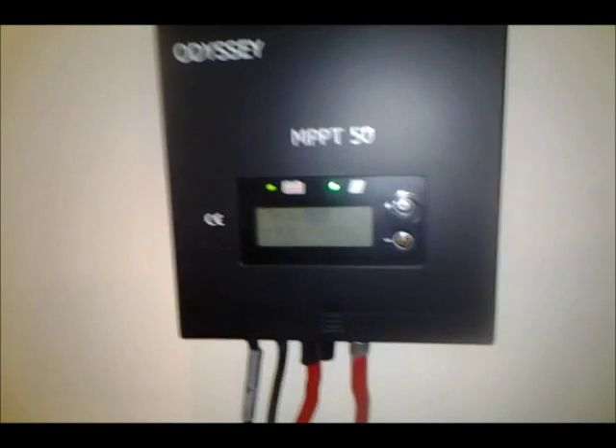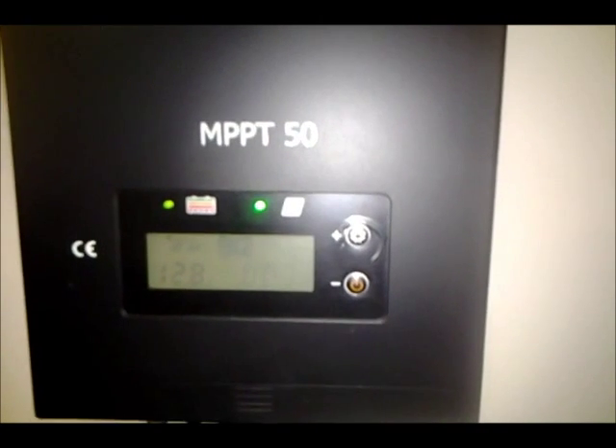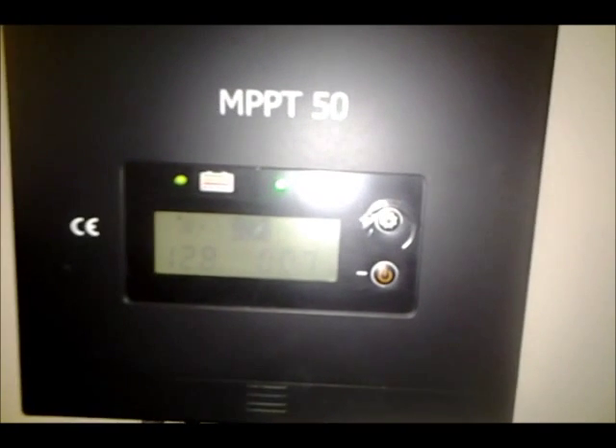A little bit about the charge controller. This is an MPPT charge controller, which stands for maximum power point tracking. It describes a process by which the solar module is always operated at the point of maximum possible power. The maximum power point can vary depending on operating mode and local conditions, and it changes throughout the day — hence the term 'tracking.' Traditional controllers connect the solar module directly to the battery, requiring the module to operate below its maximum voltage point. In a 12 volt system, the battery may range from 10 to 15 volts DC, but the module's maximum voltage is typically around 16 or 17 volts.